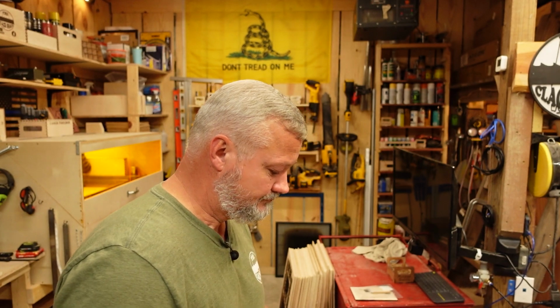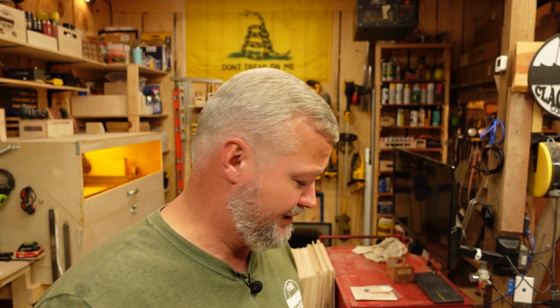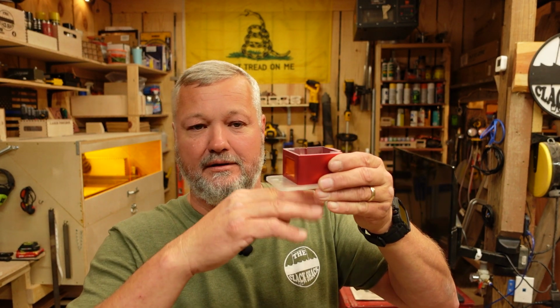So after that, guys, that's when I decided that I wanted to take the shroud off. And in doing so, I messed up the way that you're supposed to focus the machine. Because the way the machine is focused, you have the shroud attached to the module, place this underneath it between your material and the module, pull it out, and it's focused.